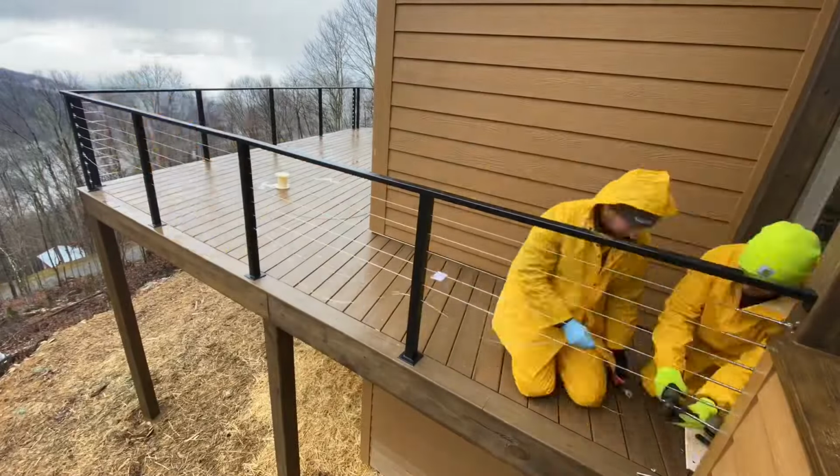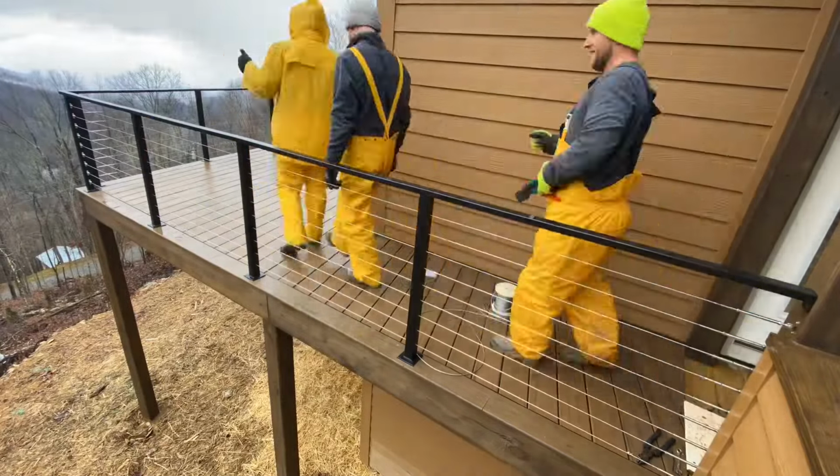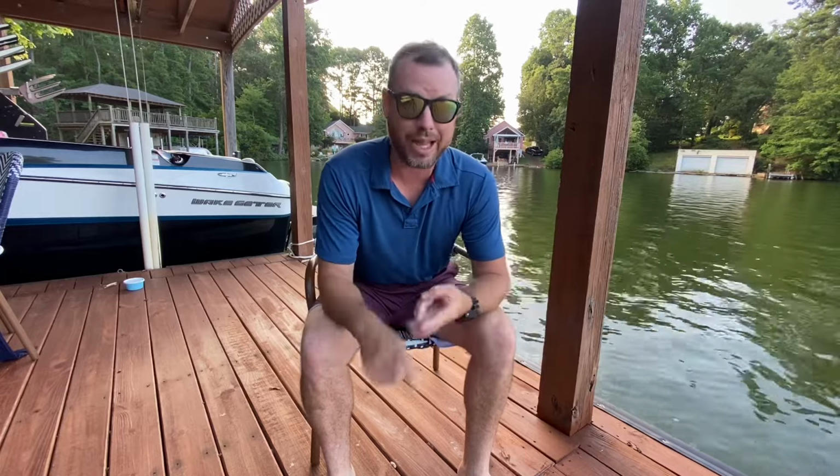We have worked in the rain on tasks where you're not going to ruin tools, okay? The main problem with rain is you're using electricity on your power tools. Your battery tools use electricity, obviously, from a battery. And all your other tools that are made of steel are going to rust and get ruined. So there's also a safety factor. If you're up on scaffolding or on ladders and it's raining and things are slippery and wet, that's an added danger factor. So generally speaking, we only work when it's sort of dry, but sometimes we'll finish a task that we've started in the rain just because we need to get it done.